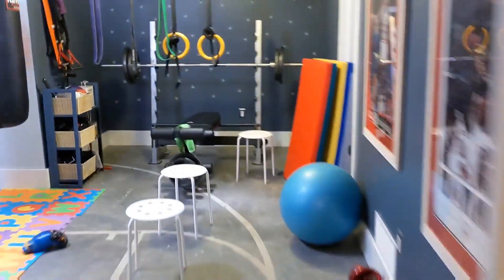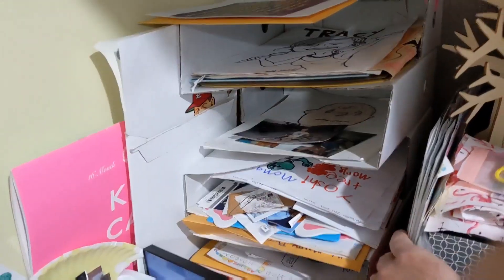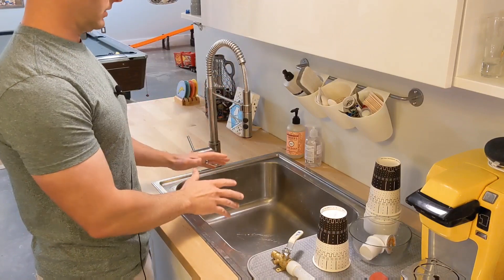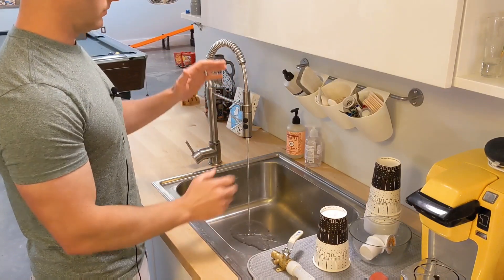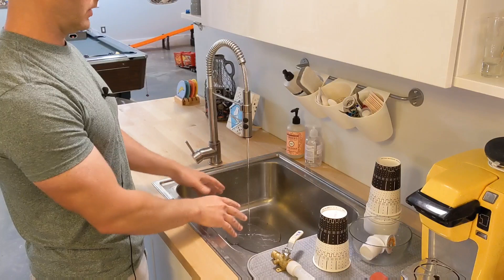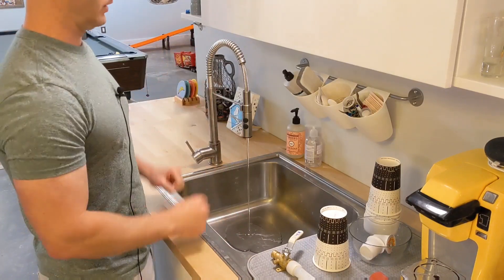In order to do this, I'm going to have to turn off my main water valve. I found it — I thought it was on the right side but I guess it's on the left side. When we bought the house, this thing leaked. I hate these valves — these twist valves just suck. Always get a quarter turn valve. I've opened up all the faucets upstairs to drain the lines, and this is the basement, so hopefully all the water will come down here and drain rather than coming through that tube when I cut it.